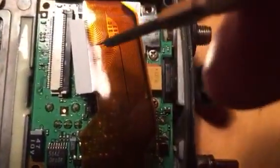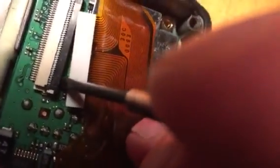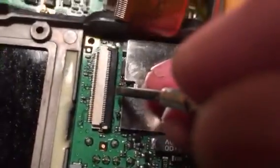Separate it here — don't pull on this ribbon cable. This catch simply just lifts. I'll show you: it just lifts up. The cable lock will come out. Separate this half, move it over, being very careful with the cables. This piece here will actually just lift — clip it out, there you go. That's also how you put it back, but don't pull on it, don't try and yank it, don't try and twist it.